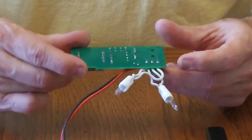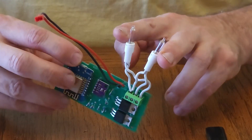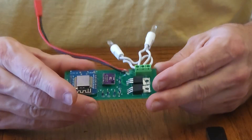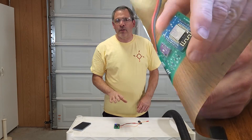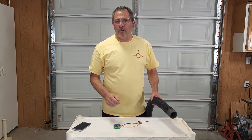The whole thing is very well designed, very well built, looks very professional. We've got two Christmas tree lights here — just temporary — those simulate the ejection charges. We're going to do some testing on this and then hopefully a little later we'll actually get to launch this. We're going to do a vacuum test, and that's a test I think you should do on every new flight computer that has a barometric sensor.